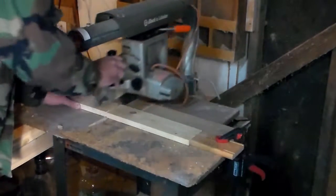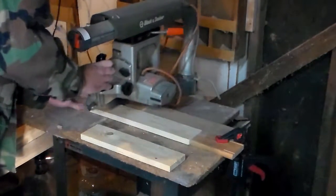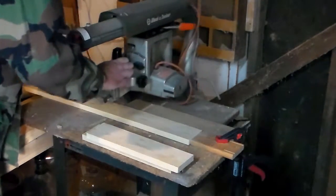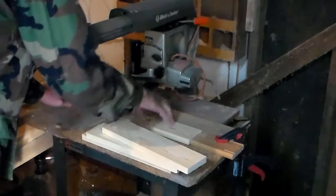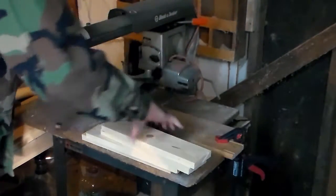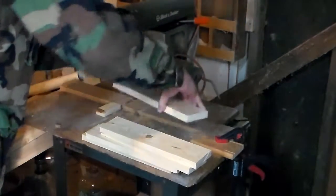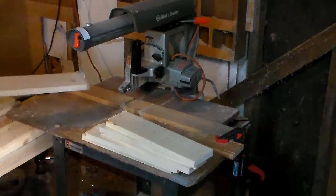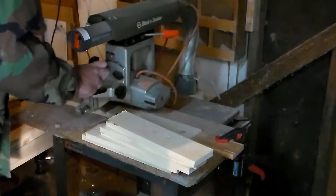up only using 4 of these, I think, along with 2 12-inch boards and 2 6-inch boards for the main part of the stool. I then used a couple of 2x4s that were just cut to size to fit between the legs, and I believe it was a 12-inch piece of 1x4 to help support those. The stool is a little bit over-engineered, but I figure it's better to over-engineer it than have it collapse on me later. Also, originally I planned on using 3 or 4 14-inch slats to make the top of the stool.